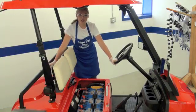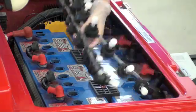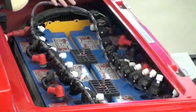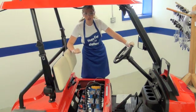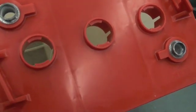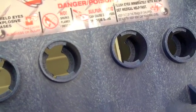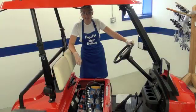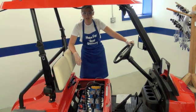Using the drawing provided as your guide, lay the fully assembled kit on top of the batteries. I'd like to stop for just a moment to mention a special battery vent opening used on US Battery 12-volt RX. This is what a typical battery vent opening looks like; this is a special battery vent opening. When inserting the valve into the vent opening, you will need to be careful to ensure that the float on the valve clears the internal obstruction. Damage will occur to the float if you push it into the vent well before it clears the obstruction.